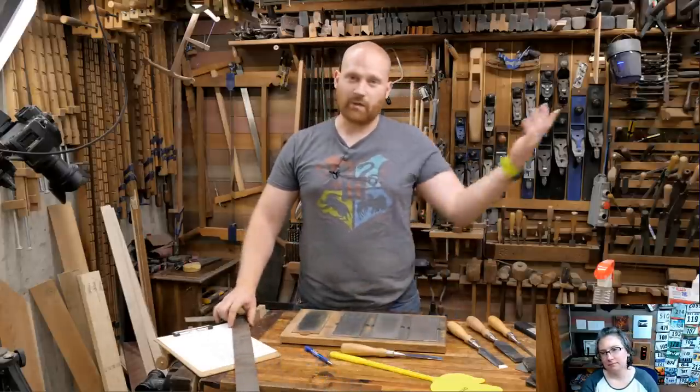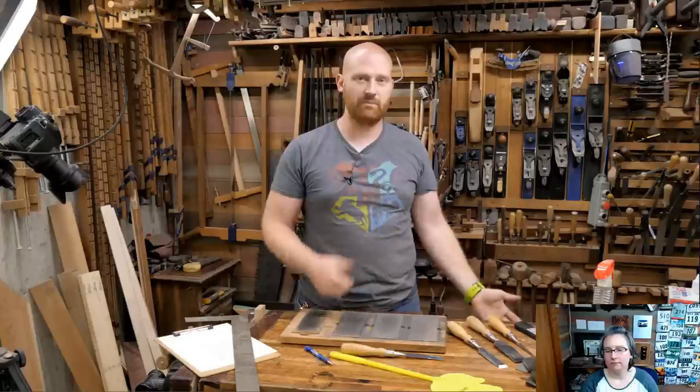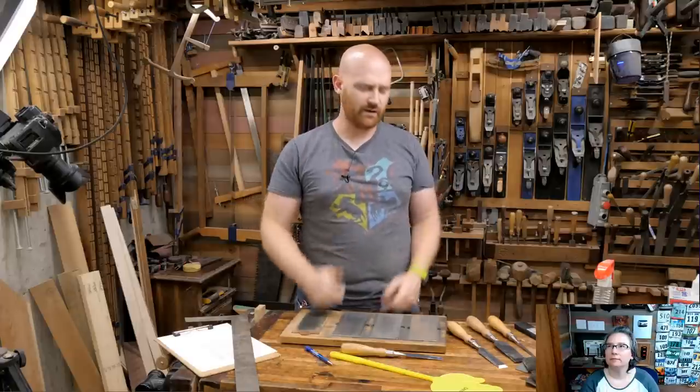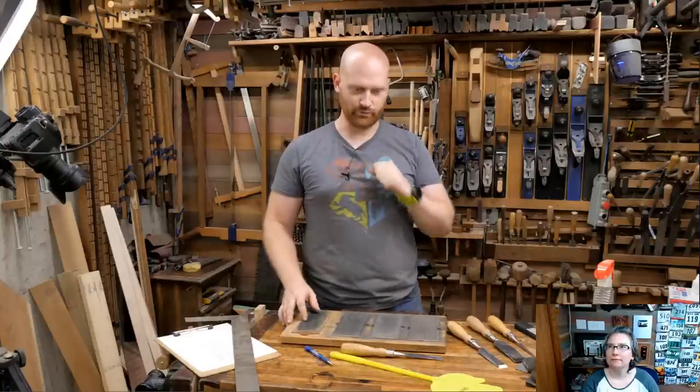But there's a lot of other people out there who do it very, very differently. I know many good woodworkers who do love that secondary bevel, and they'll put it on there all the time. Particularly with planes, I know a lot of people like to do the back bevel, particularly Rob Cosman with the ruler trick. He loves that thing. It's one more step, and so it's something I don't like to do, and so I'm going to be showing you today without that.